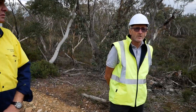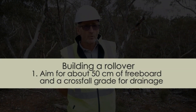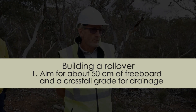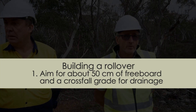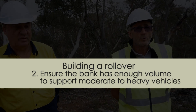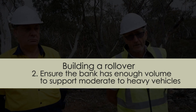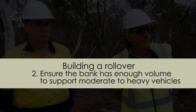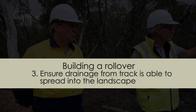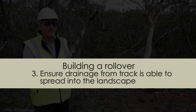This bank gives a good illustration of the principles to keep in mind when building a crossbank. First, aim for about 50 centimetres of freeboard to provide good storage and prevent overtopping, with a slight crossfall grade to allow drainage behind the bank to avoid bogging. Second, ensure enough volume in the bank so it is drivable and the grades approaching and crossing it are trafficable for both four-wheel drives and larger vehicles. Finally — and very importantly — where the bank drains onto the hillslope, the water should be spreading out and dispersing, not concentrating, giving runoff the opportunity to soak into the soil.